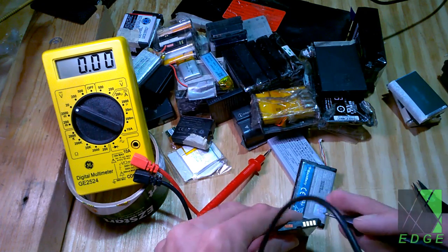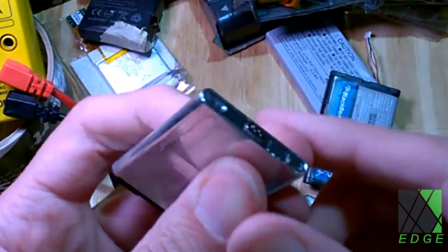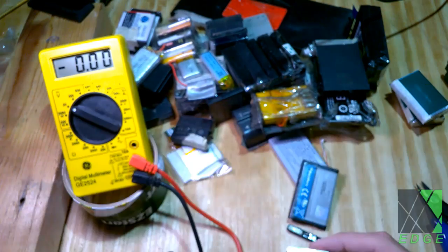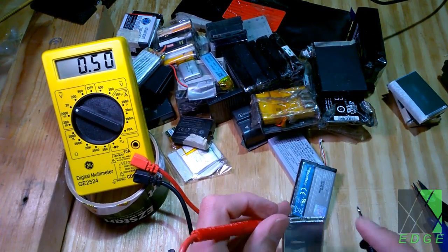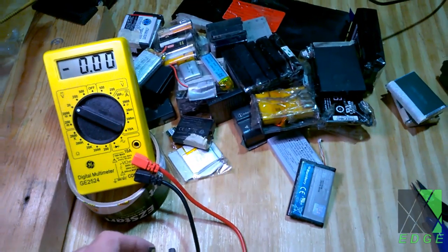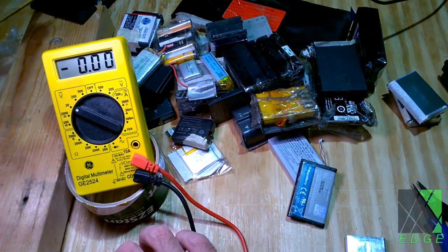I get about 0.01 of a volt, so basically it's turned off. I ripped the top off — admittedly risky — and you can see that's the end of the cell. It's an aluminum encased cell. Without the battery protection on there: 2.04 volts. So the battery isn't dead — there's a little circuit hiding in here with a microchip. I could just charge the cell and leave that circuit in there, but I'd prefer to connect straight to the battery and remove the circuitry if I can.